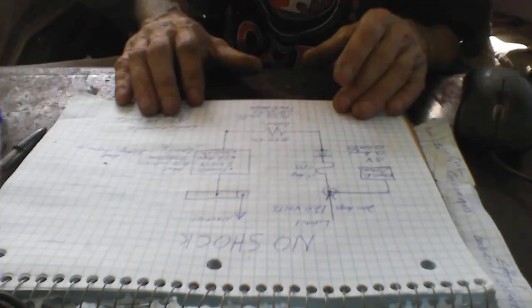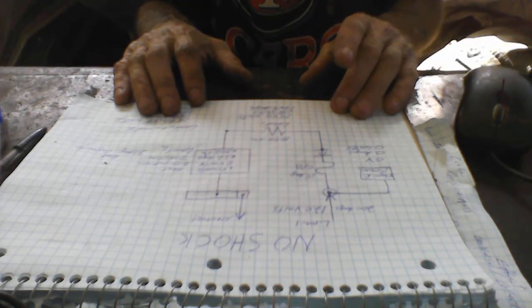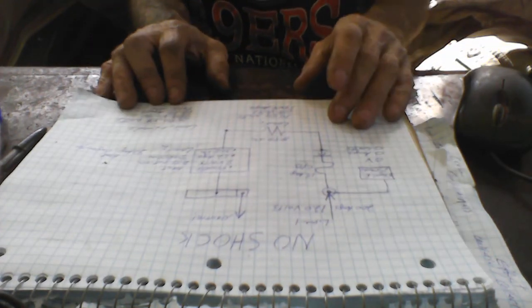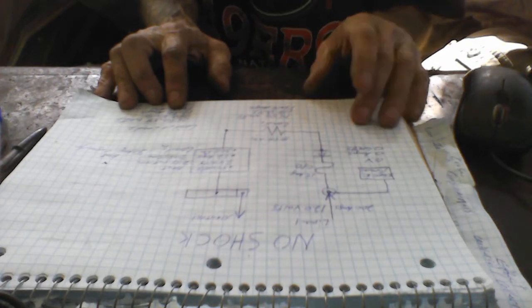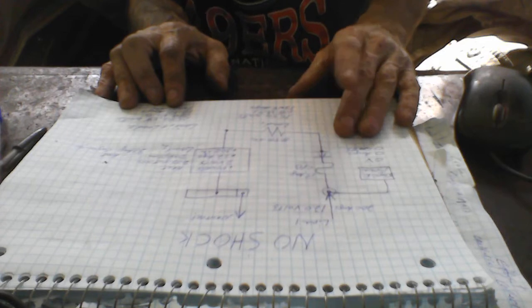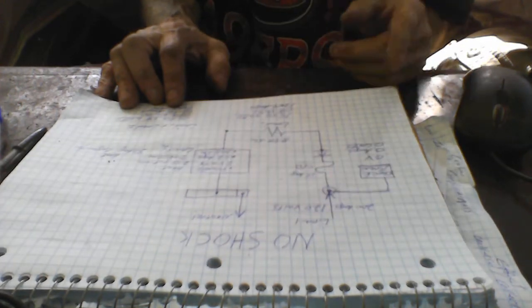considerably. It dropped as much as 8.45 amps. And you would expect it to drop somewhat. The total load is 12.92 amps, so you'd expect at least that. It dropped well below that. I expect it's something to do with the heat dissipation device, but I can't prove that at the moment.